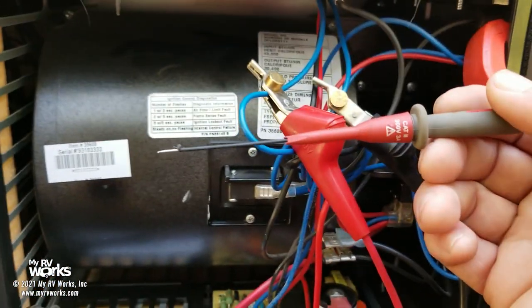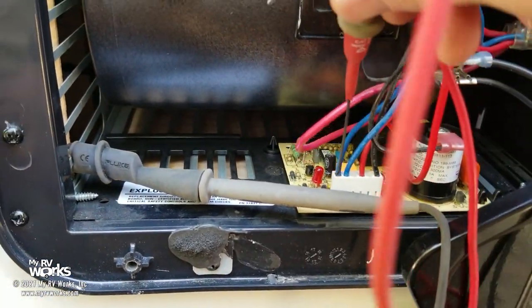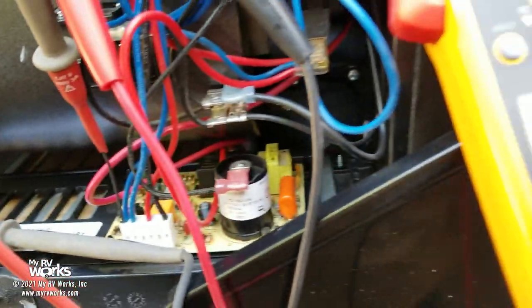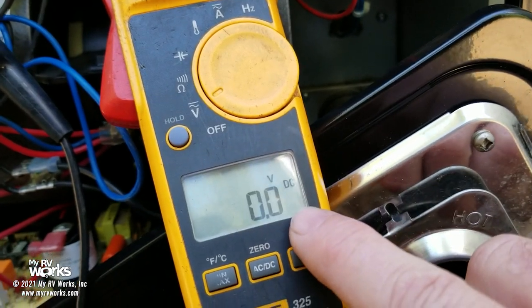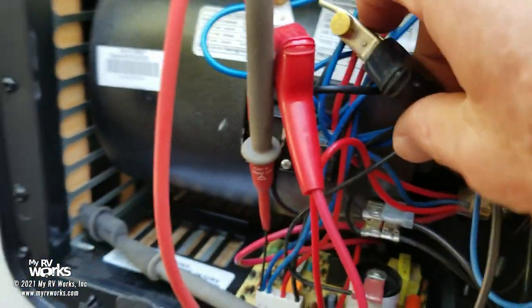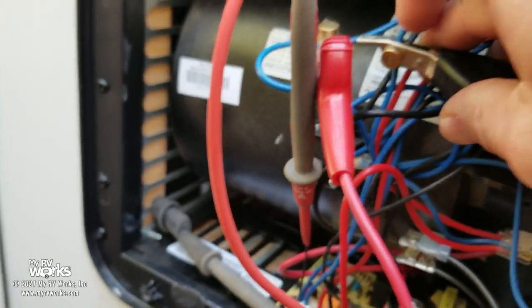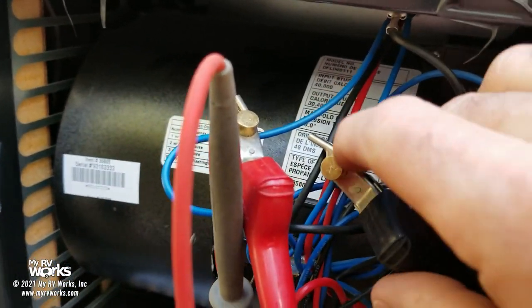When it's cold, the furnace will ignite and reach temperature, then turn off — everybody's good. But then when there's another call for heat, the fan will come on and the furnace won't ignite, and then the fan will just turn off. If that happens on this style of furnace, come out and see if the light is blinking. I like to use these little piercing probes — wiggle your wires — but on this board it's going to be the leftmost pin.